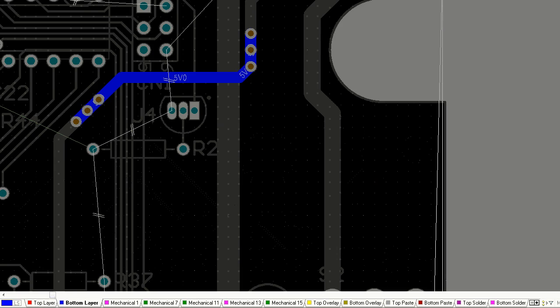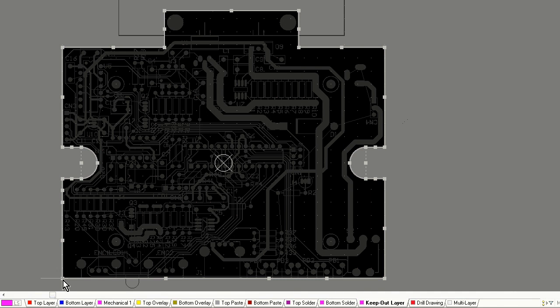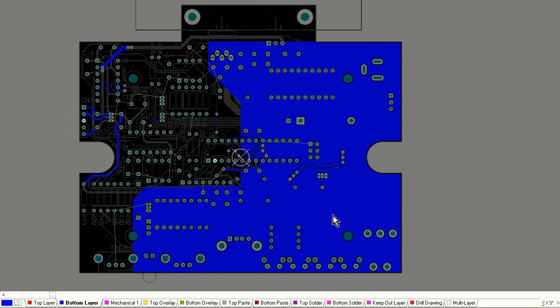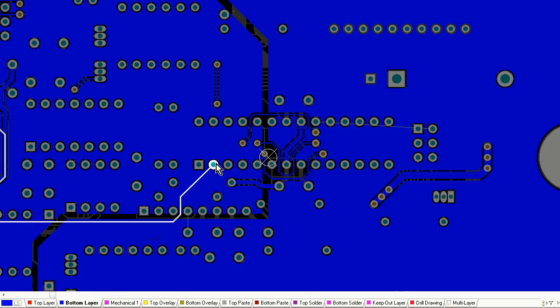It was coincidental. I'm now placing the outline of my polygon around the outside of the board. This will be my ground polygon. So I'm placing that on the bottom layer, and you'll see it. I'm defining the outline, and then the program will automatically fill in the ground layout. Now what I'm doing, going down the center of the board there, is I'm going to split this ground basically into power and signal side. So all of my power, there we go, I just filled in the flood. I got the flood fill there. I can edit that later. I can tweak the finer things later, but there you go.